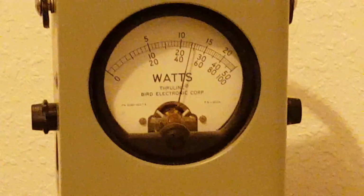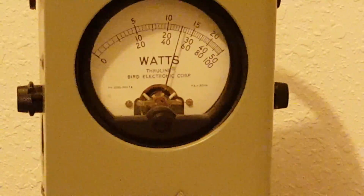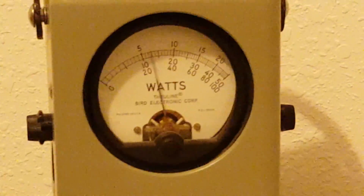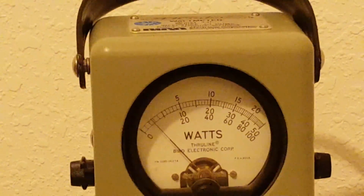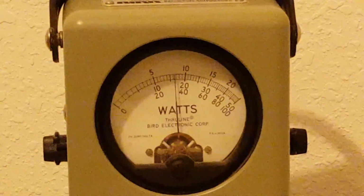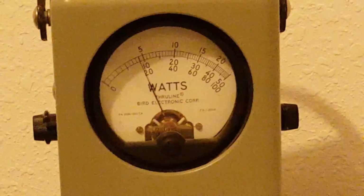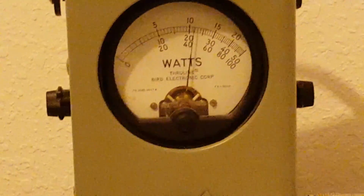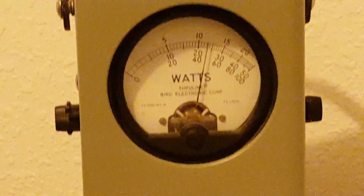Audio 1, 2, 3. So we've got our bias cranked up, and we're down on our peak output to about 500 watts. And we're keying about 40 watts right there, so that's not too bad. And you can raise the carrier up a little bit on your radio. That's about 3.5 watts going in. Audio, and we're dead keying about 50. Swinging almost 500.